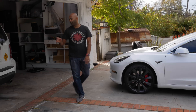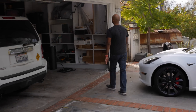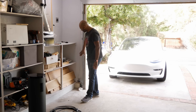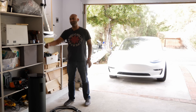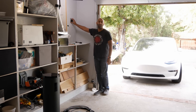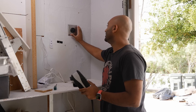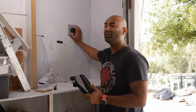The next thing is to figure out where you want to mount your outlet. My wife will be parking her SUV on the left side, and because of the shelving unit near the garage door, whoever parks on the right can't access the right doors. So this is where I ended up installing my NEMA 14-50 — a 50 amp, 240 volt outlet here in the U.S.